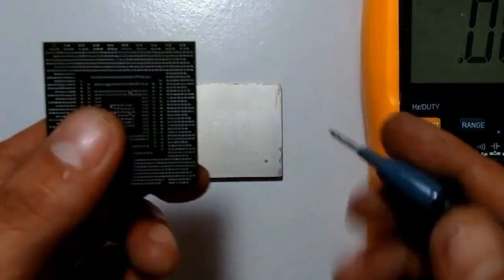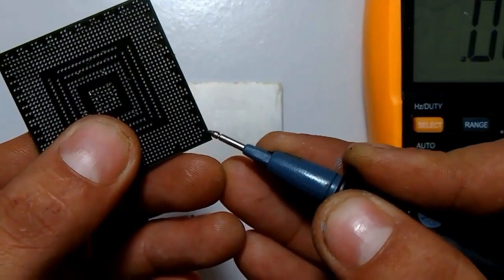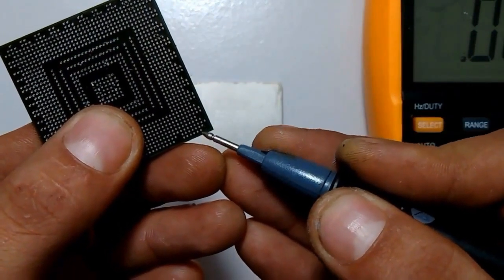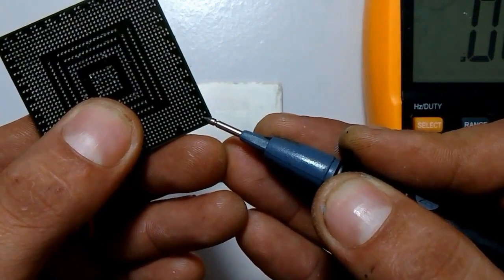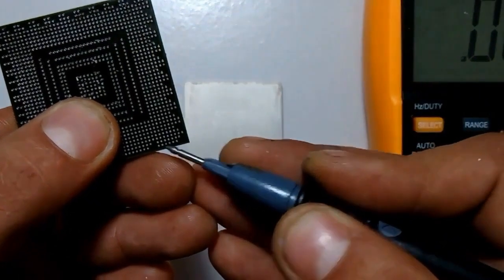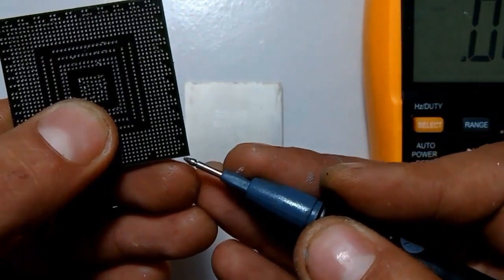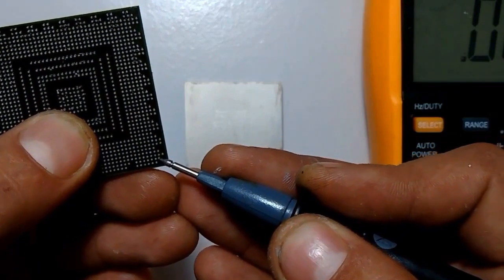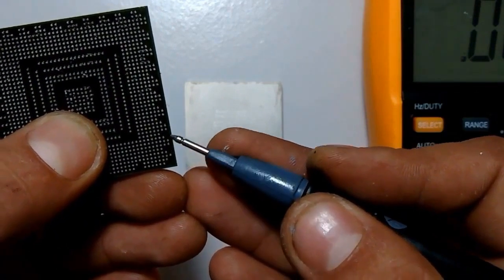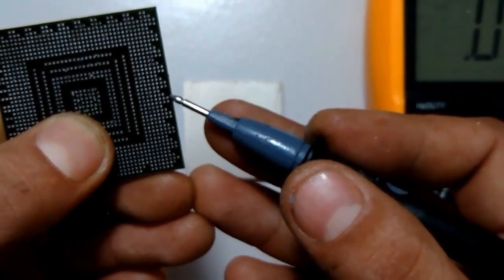So what am I going to grab here? Let me see if I can show it from here. I'm going to take the following. Look, here we have 3 spheres. See, 3 sphere feet. So we are going to take this middle point here, right? You can locate yourself here by this groove. Then you will take this middle point here with a probe. And here you will count. See? 1, 2, 3, 4, 5. You will grab this little ball here.